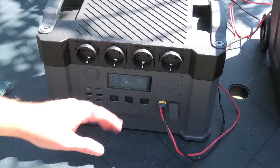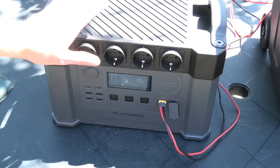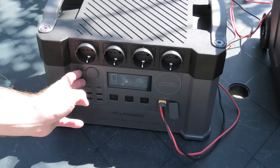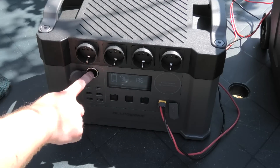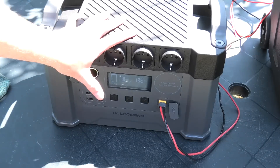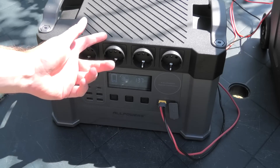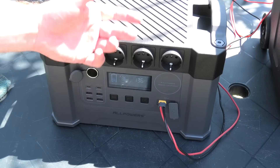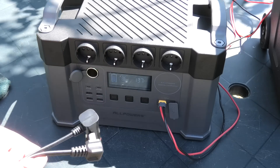At the moment the power station is happily charging up from solar — it is at 86%. This can both do 230-volt AC and 12-volt DC. If you want to run a refrigerator like this, DC is way more efficient than AC. If we use AC, the power station will first take the DC in the batteries, convert it to AC, and then send it to the power brick adapter for the refrigerator, which will again convert it back to DC. If we use DC, it just goes DC to DC — way more efficient.